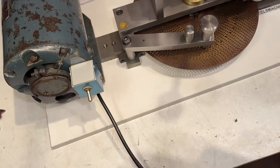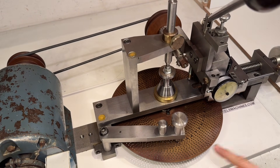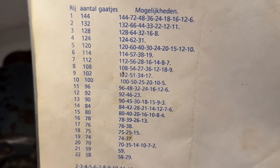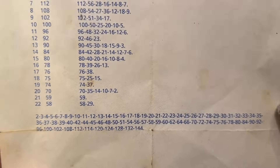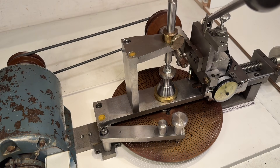The torque goes into the rubber and yeah, low sounds — it's friendly to work with. It comes with a very big dividing plate. Here's the list of all the possible divisions. And I decided this is a beautiful opportunity for me to, for the first time in my life, make a gear.